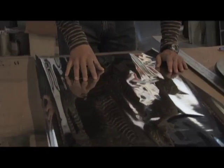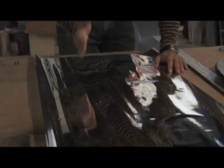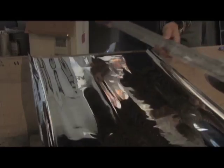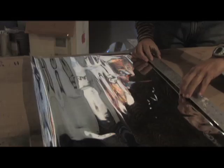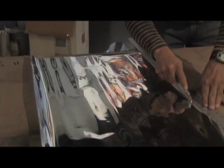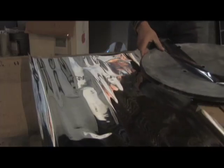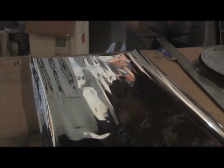I like to do the strips with this because it's a lot easier to put on. You can try and cut pies, but they're going to overlap because it's not a perfect pie like you'd think. I like to do two-inch strips for the simple reason that most straight edges — larger ones — are two inches wide. So you can basically just line it up to the edge, get a razor knife, push it down nice and tight, and you end up with nice strips that are two inches across. I'm going to go ahead and get these cut.